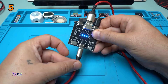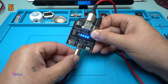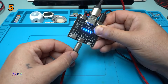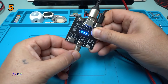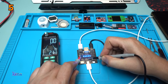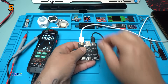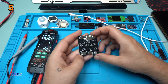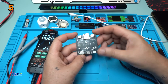When you move the connector, one of the LEDs is flashing. The ground connector is bad. Testing the positive power supply — yes, we have continuity. It's a simple board module that you can use to test your cables for one dollar from AliExpress.